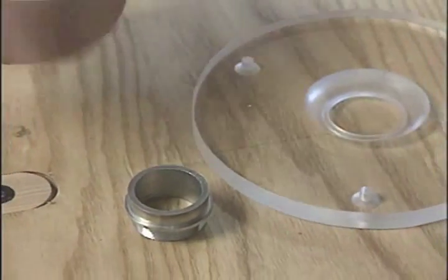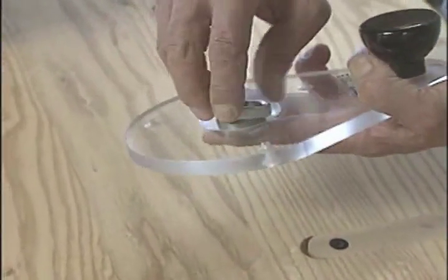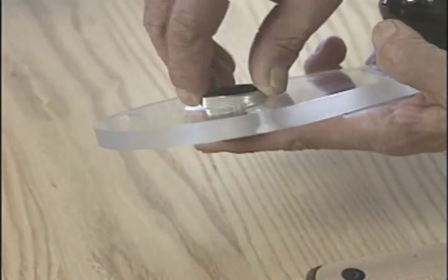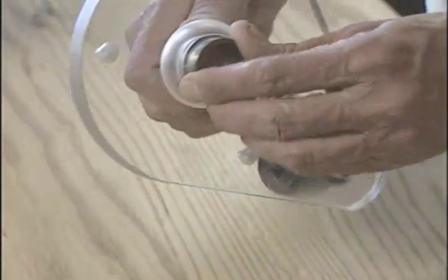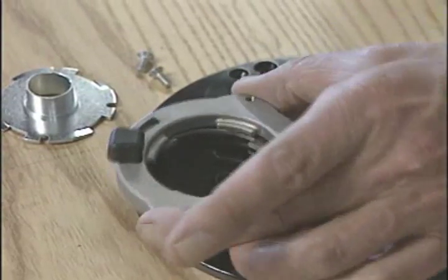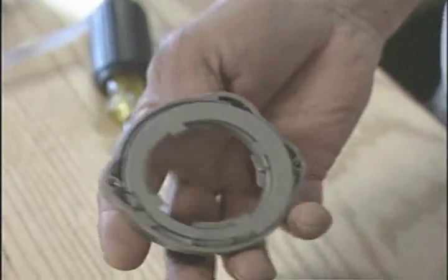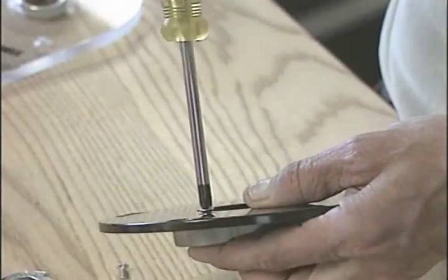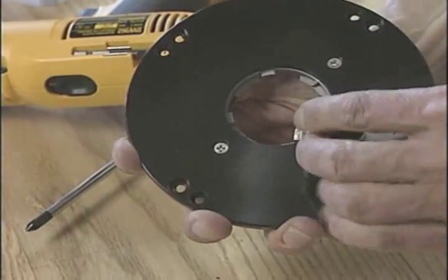The Porter-Cable collar guide is a two-piece screw and nut affair that fastens together from both sides of the subbase. This accessory offset subbase I'm connecting it to will give you better control, especially when you run out of the supporting surface for your router on tight corners. The Bosch Bayonet system uses a spring-loaded holder fastened with screws to the subbase. The variously sized collars snap in and out.